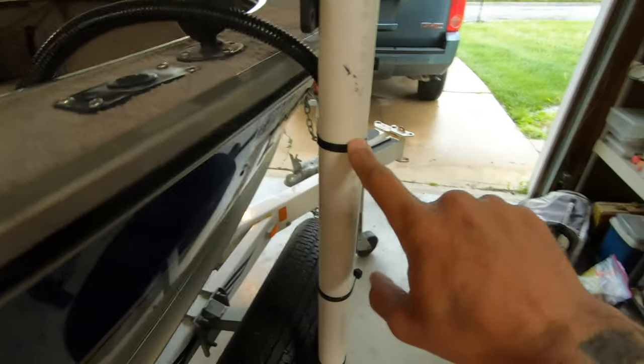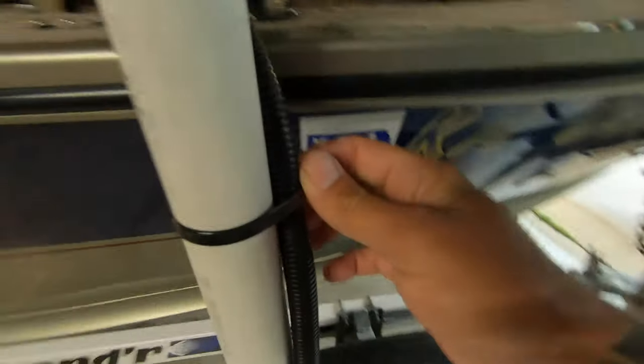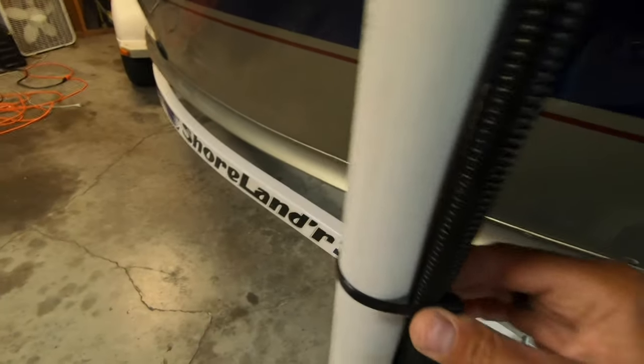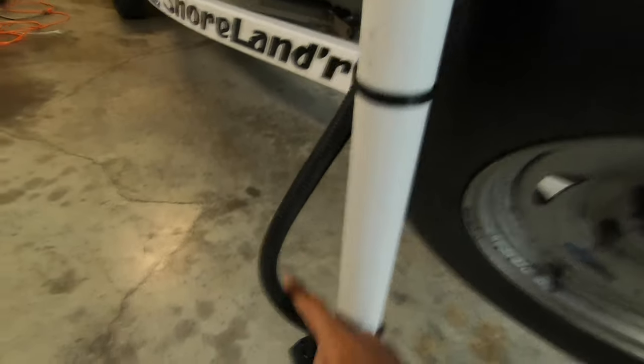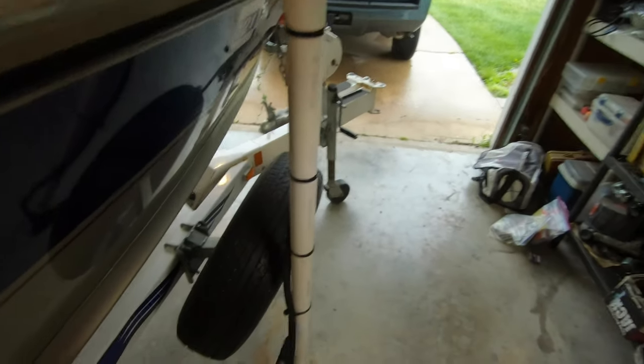That wire loom is very important to protect the transducer cable, because there are tiny intricate wires inside that cable — if you pinch and break them, your transducer is done. The manual does not recommend zip ties; it recommends electrical tape. I did have electrical tape on it but got tired of how it looked. The manual does say zip ties can be used, but they cannot be over-tightened — all my zip ties have a ton of play in them. Leave enough of a loop at the bottom so you can spin freely without twisting the cable. I can rotate this a full 360 with that loop. Zip ties aren't recommended, but if you use them, just don't over-tighten.